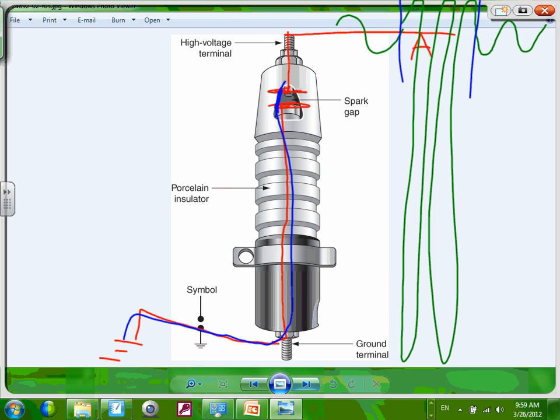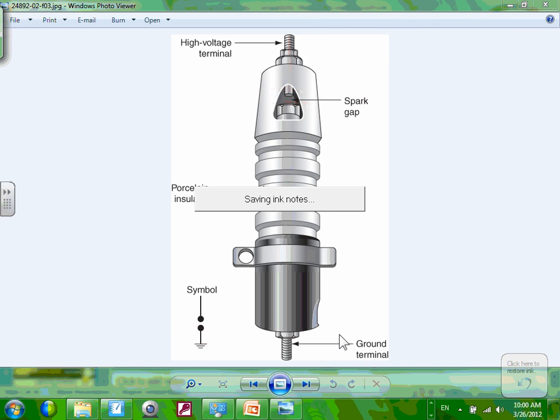What makes this close? It's really a gap. But because of the high voltage, the gap is designed to jump if the voltage goes higher than the normal voltage. And they have a rating for it. So if it goes higher, because of lightning or switching transient, it just closes, shunting phase A to the ground, and the same thing phase B and phase C to the ground. Momentarily, for milliseconds, guys. So who cares? Now you protect your equipment from damage. Your equipment is protected. Any comments, any questions?